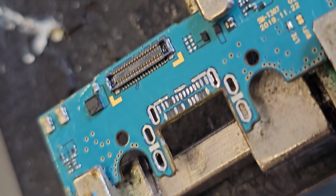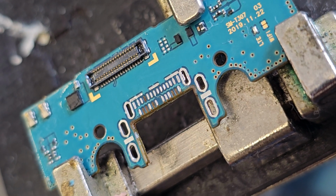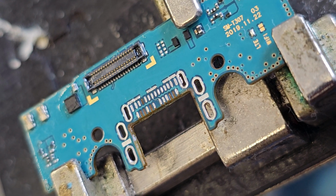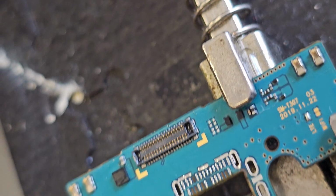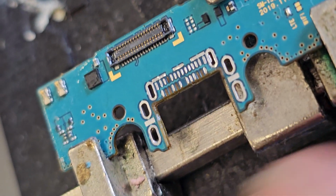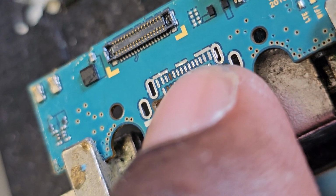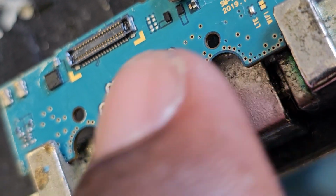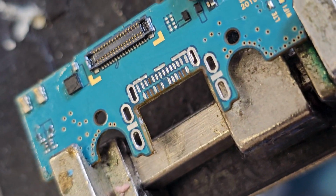Okay, and this is after proper cleaning. A couple more are missing. Not much I could do about that. So what I'm going to do now is flux a low melt solder piece here, and then I'm going to do these, flip the board over, and solder the ports in, and then I'll just heat the whole thing in place.